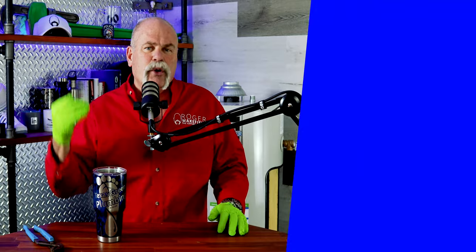So get ready to turn your water back on. Go to a bathtub or somewhere like that. Open up the hot side to blow out any air. And give it a minute. Let it run freely. That way, you get it all cleaned out. Once you get your water back on, turn on your gas, light your pilot, or turn your electricity back on. This is one step that can help you make your water heater last a lot longer.